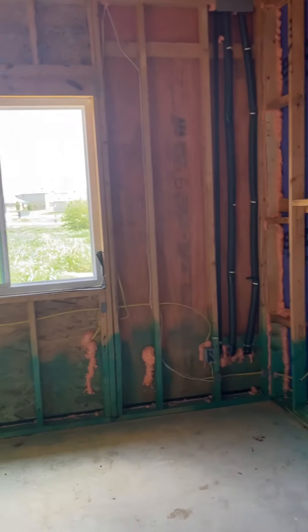Here's another area where you've got a lot of plumbing coming in — they have an outside tankless water heater and this is that plumbing. When you're putting stuff up, you want to avoid this corner. Also, you can see on your windows you've got extra studs. I always tell my clients: take some pictures so you can see where your wires and cords are, so when you're hanging things later you know where everything is.